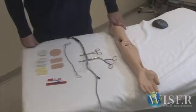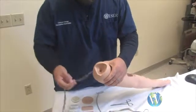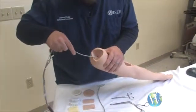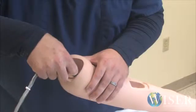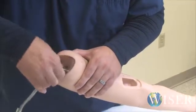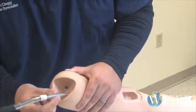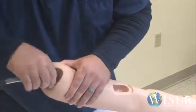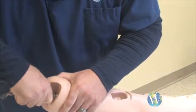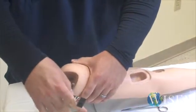So now let's run this wire through this arm. To reinsert your wire — whether you're replacing it or whatever reason you might have had everything apart — you start at the top. It's tough. You've got to kind of shove them through, but you want to be gentle because you don't want to break anything. Once you get all this through, this clear tube you want to get through as well. Once you get that in, shove it all the way down, because you still got to run this back through the simulator and get it to its connection inside.